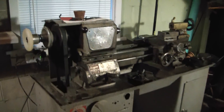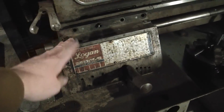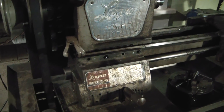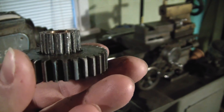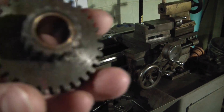We're gonna work to get this sucker running. The big catch aside from the motor is that the gearbox here has a couple of stripped teeth. So I'm gonna have to try to find new gears, or maybe have one of my old machinist buddies put one together for me. It's a double gear, and you can see this one is just all worn out. I might be able to get in touch with one of my machinist buddies and have him machine me up something.